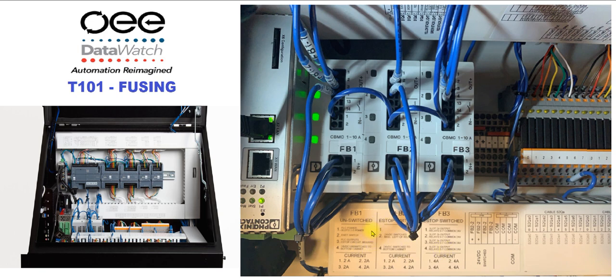Keep in mind that the power supply will fold back at 20 amps total. So everything right at the fusing level would be 32 amps and you'd be folding back. But usually everything doesn't run at the same time. You have to make decisions of what you put on each.